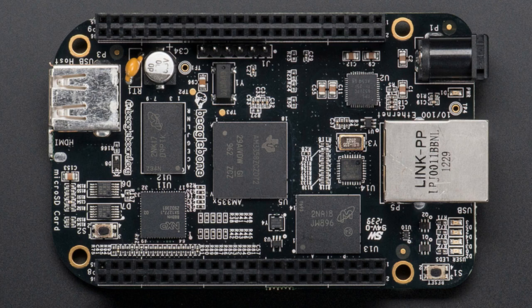There's only one problem: you needed all these chips on a six or eight layer board, because you needed this main processor — a Cortex-A8, the Sitara processor — you needed some RAM, and you needed a power management IC that was kind of custom-made for it.